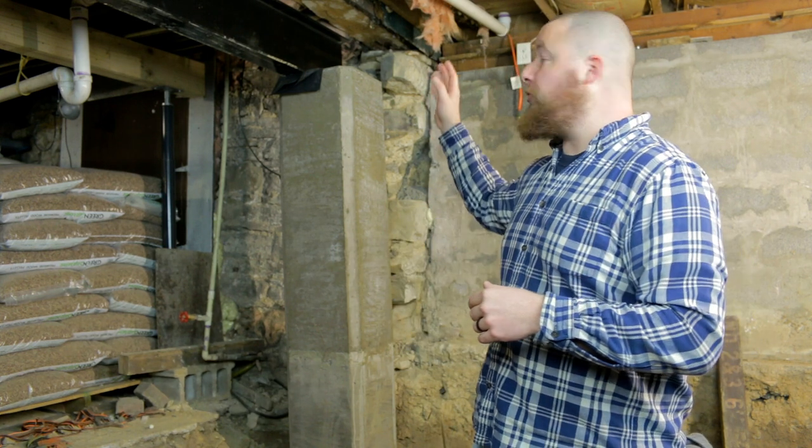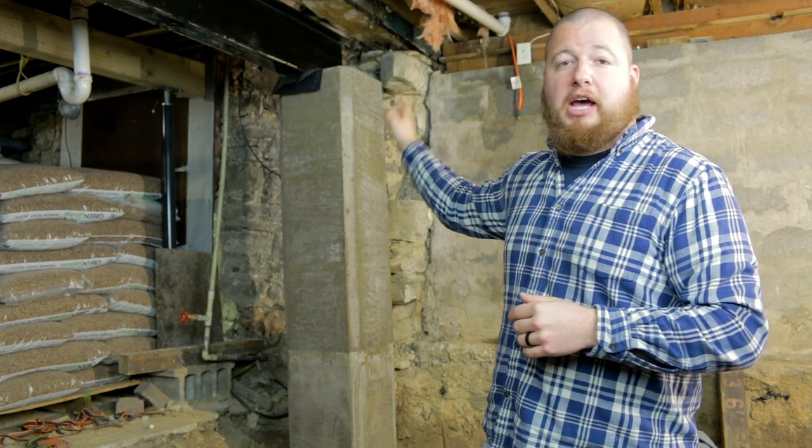All right, guys, so that wraps it up for this video. It is our ninth and last video in our foundation repair series. The only thing that we're going to do beyond this is permanently pin our I-beam down to our column. We're just going to drill down through the flange and place anchor bolts to permanently set it.